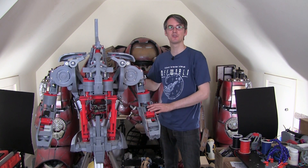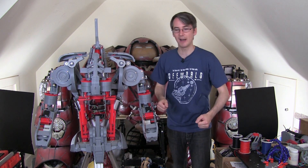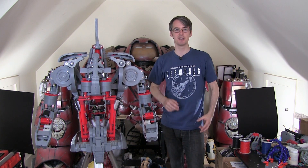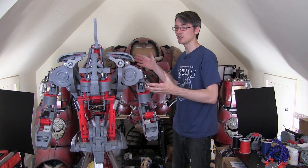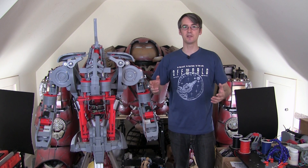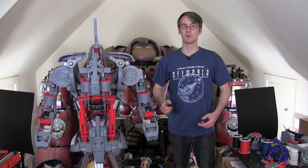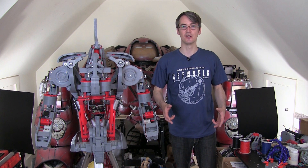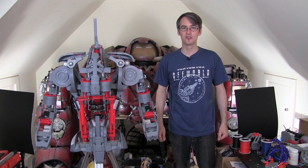I want to address some comments from the last video about the apparent wobbliness of this robot. When it moves around you can see the whole thing wobbles, and that was by design - the spine is made of ninja flex. I have two more actuators in the abs which are going to bend it around, and also flexible parts in every joint which will have series elastic actuators with force sensitive resistors, so when you push a joint it will sense you moving it. There's also an inertial measurement unit in its body so it can stabilize itself and sense when you're pushing it. Although it looks like it's wobbling now, that's going to be a feature of the finished robot when it's controlled by its own AI.